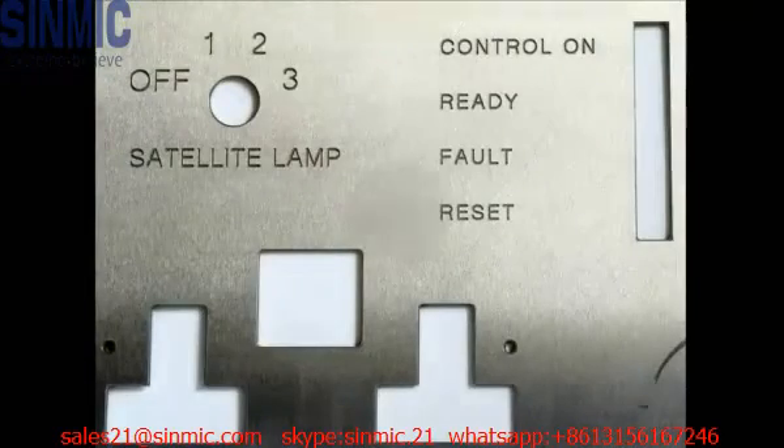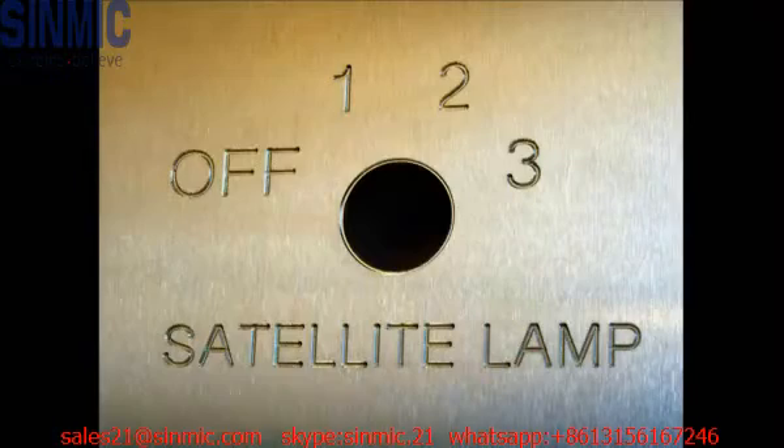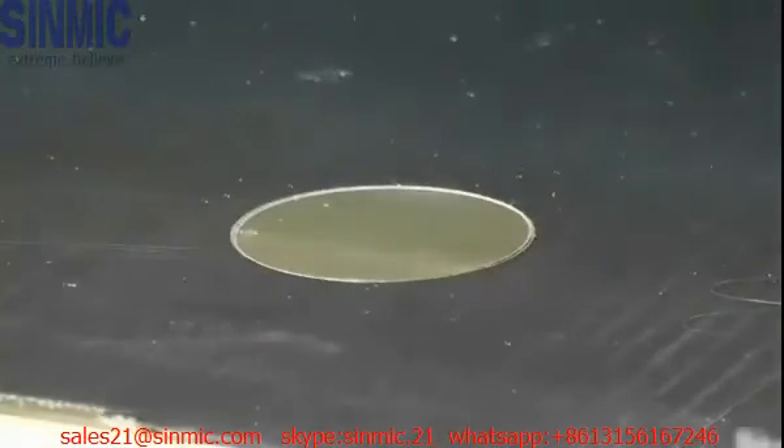With some corner sharpening applied to improve definition, I will be engraving a sample with a 30-degree coated carbide engraving tool with a 0.2mm tip — that's 7 thousandths of an inch — then cutting the sample out with a 3mm single-fluted spiral cutter, that's approximately a tenth of an inch.